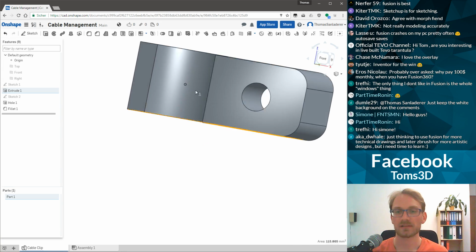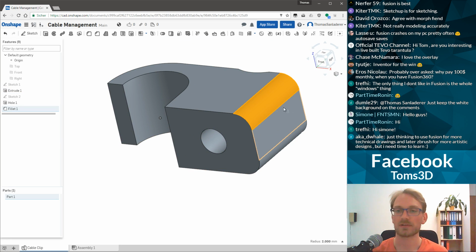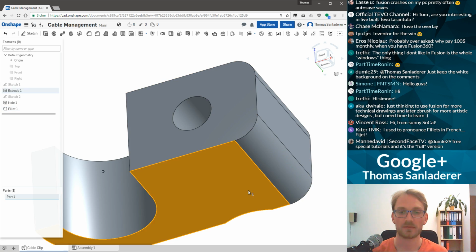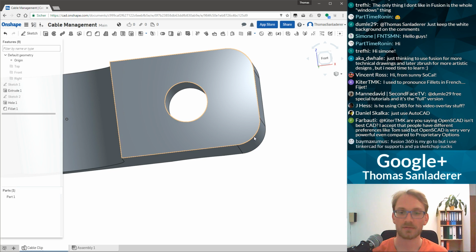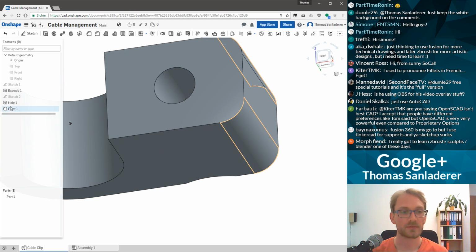The thing is, if you look at these fillets, this one up here is fine. This is not an overhang at all. However, this one down here creates a basically vertical overhang right down there. So this is the printer's bed right there, and right here you are starting out with an extreme overhang. So this thing is going to curl inwards, and it's going to create a very nasty shape in here. I don't like that. It's not a great thing to do for 3D printing.